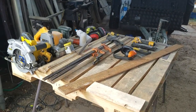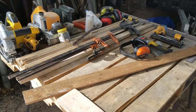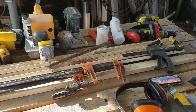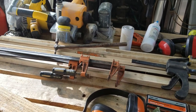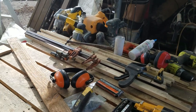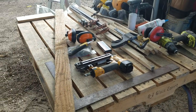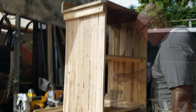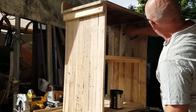Which is very compact. For doing this kind of work, all you need is rudimentary tools. It speeds things up if you've got some power tools — I've got a skill saw, a heavy-duty belt sander, and a nice orbital sander. You'll also need some PVA glue, screws and nails, an electric drill for drilling holes close to the end of pieces of wood, a square, and a tape measure. I've also got a pneumatic stapling gun so I can fire nails in without risking bruising the wood with a hammer.